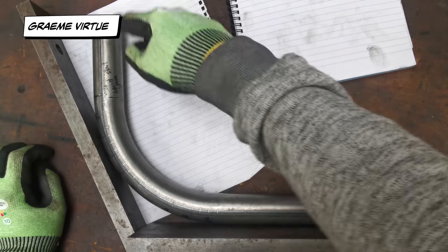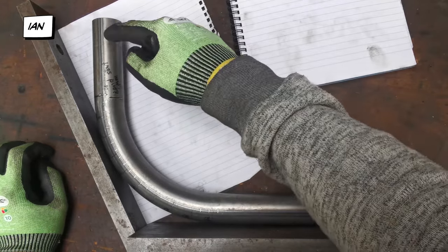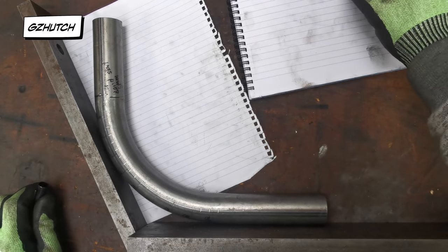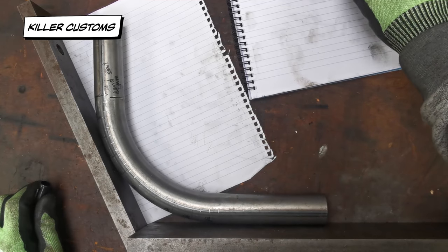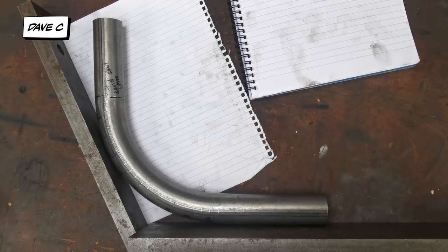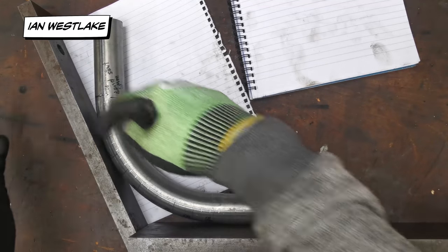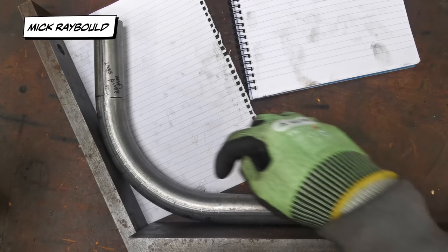This is 90, so all you're doing is adding on the 25 degrees extra - that is going to make that bit go flat against that bit. So we reckon 90 plus 25, that's whatever that bend there is. That's what you would bend the piece of tube up to in order to replicate that angle. It is not an exact science doing it this way.